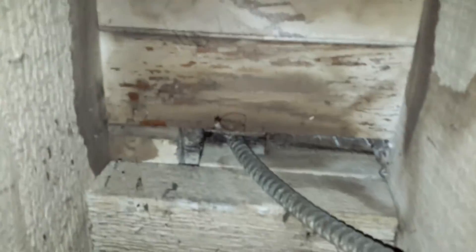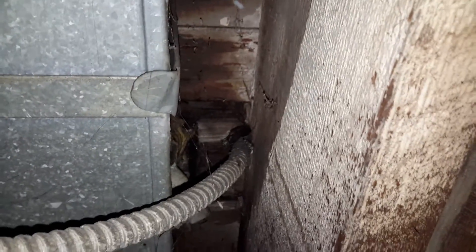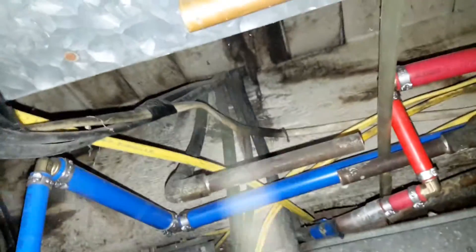Right here I have one going up through the wall and it might go to the second floor, so that line might split something upstairs. Here's another one — these could also be first floor plugs. Either way, disconnecting and splitting those up is a good idea. That one doesn't go up — it goes into a box. We're just looking for wires that go up to the second floor. Here are two newer ones, but that very much could be a second floor run.